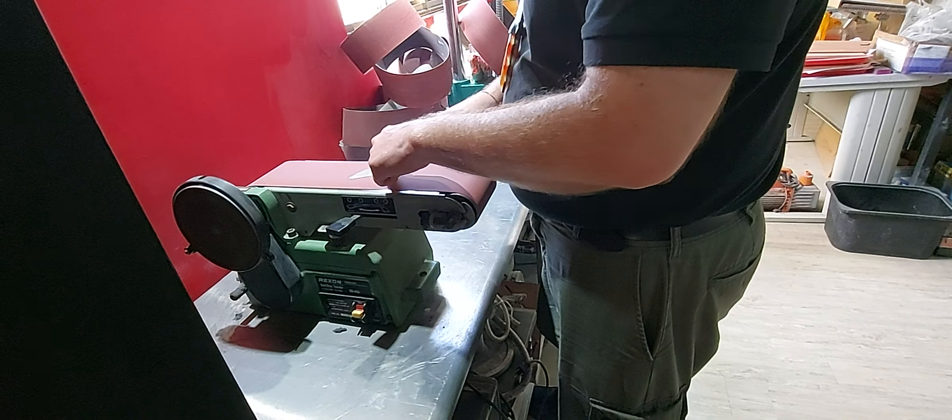Okay, so I've got my burr going. Next we'll shoot over to the buff. One of the tricks before you do the buff is to just use the belt — take a few passes. The burr that built up with the grinder is really substantial, so a few passes will minimize that burr. You can still see it's kind of there, but it'll get rid of a lot of the buildup and make the stropping better.